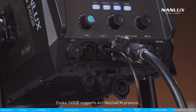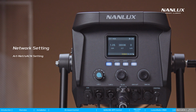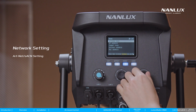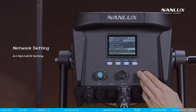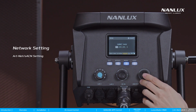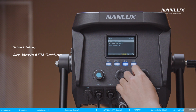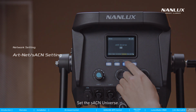Evoke 2400B supports ArtNet sACN protocol for connecting multiple lights in series via LAN 1 and LAN 2 ports. Set the network mode. When manual mode is selected, the IP address, subnet mask, and gateway address can be set manually. Set the IP address, subnet mask, and gateway address. Check the MAC address. Set the ArtNet sACN state. Set the ArtNet universe. Set the sACN universe.